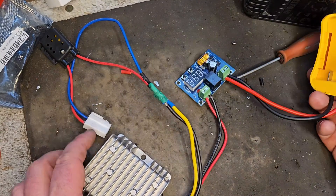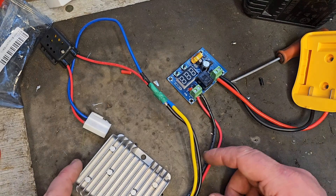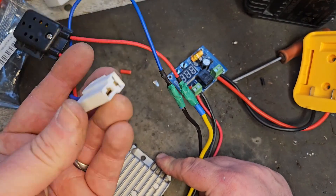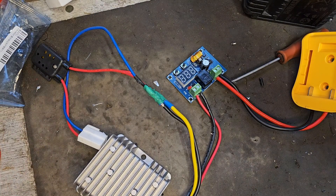This is all connected: the battery goes on here, onto the voltage over-discharge protection board, then onto the voltage dropper which drops it down to 12 volts, and comes out here onto the switch followed by the motor of the vehicle. So hopefully that'll sort it all out.